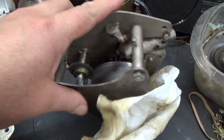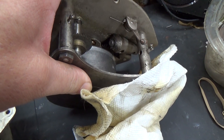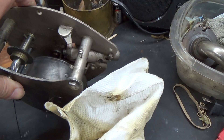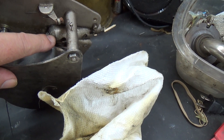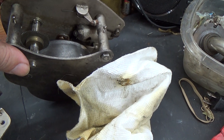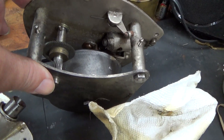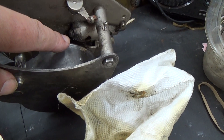The temptation is to leave it alone since it's not under major pressure, but it turns so much smoother when it's clean. To disassemble: take the screw out, lift the plate off, punch the gear down through — it comes right out. On the back there's a little wire clip — pop that off carefully with a screwdriver so you don't lose it, then the shaft pushes right out. There's a small thin washer at the bottom — don't lose it and make sure you put it back.